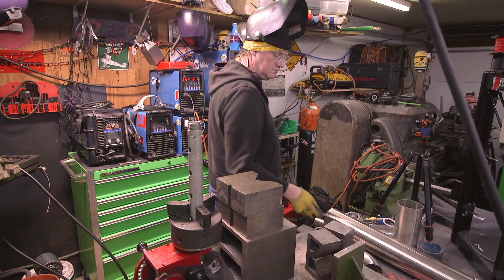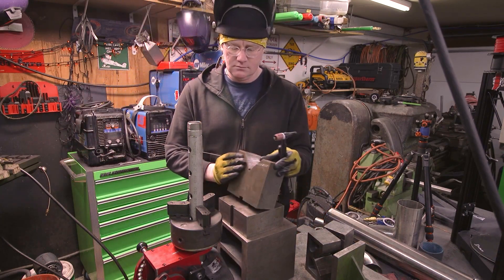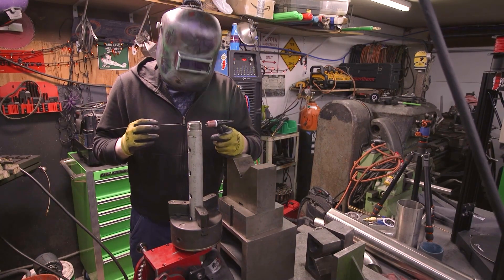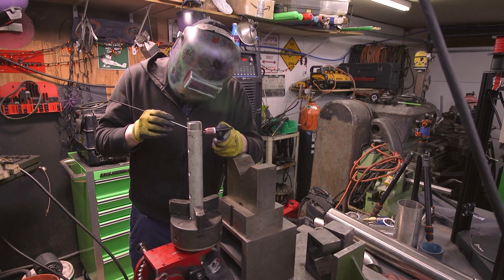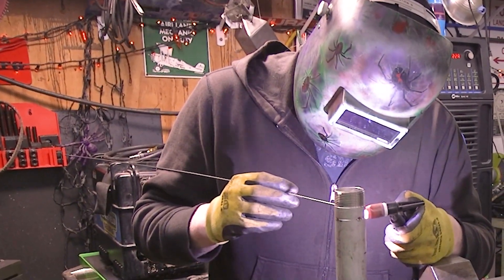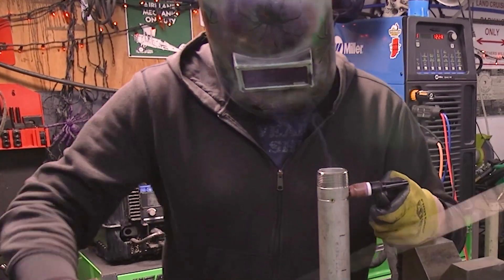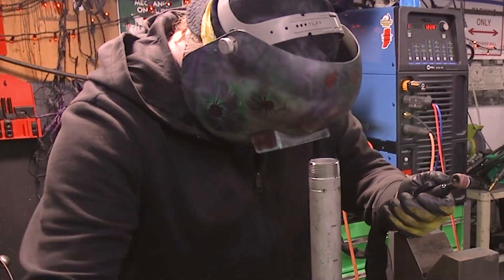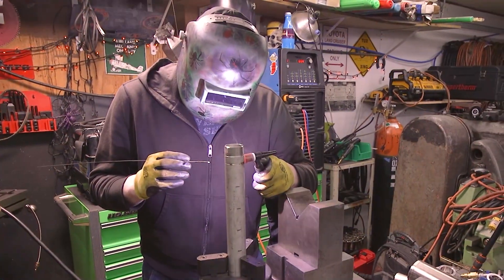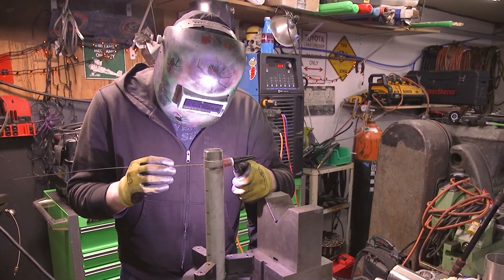We are building a stainless steel steam header. What this is is a piece of inch and a quarter schedule 40 pipe. I opted to weld on a half nipple here — what I'm getting ready to tack on there is a half nipple that I purchased from McMaster-Carr. I have a pipe threader but it doesn't really do that great a job on the larger diameter parts, so we just went ahead and bought a half nipple and welded it on to the body of the header.